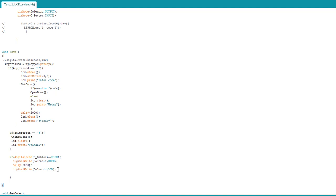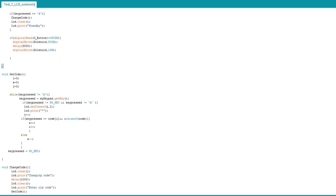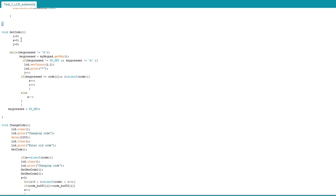In the loop, we constantly read the key from the keypad. If it's star, it triggers the sequence to open the door. If it's pound, it triggers the sequence to change the code. If the inside button is pressed, it opens the solenoid directly. When we press star, the important thing is the get_code function. The get_code function sets variables to zero, and as long as the user hasn't pressed A, we stay in the while loop reading keys. Each typed key is displayed as a star to hide the code.